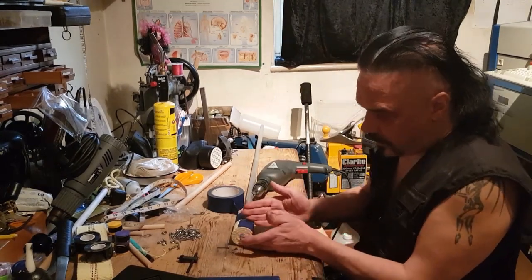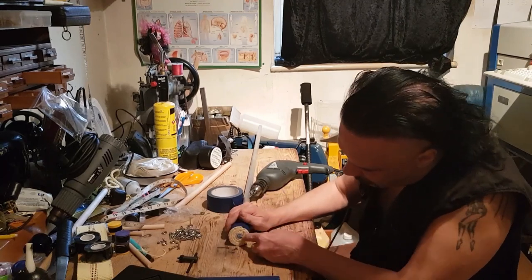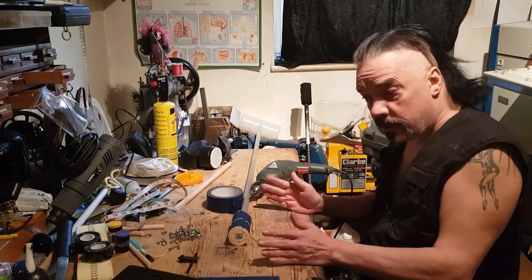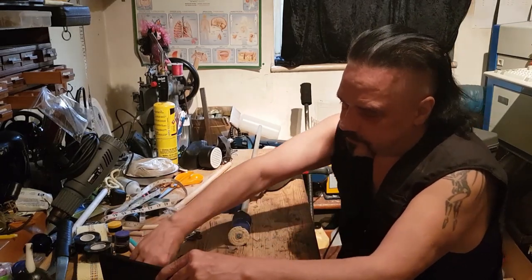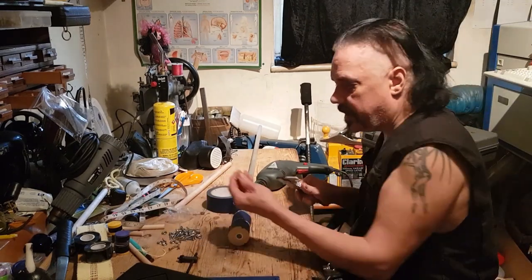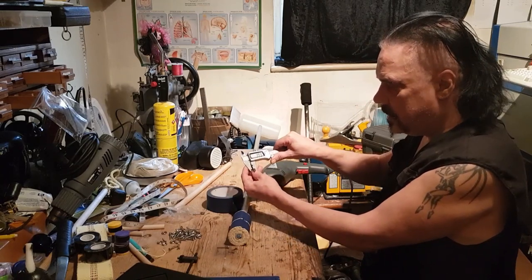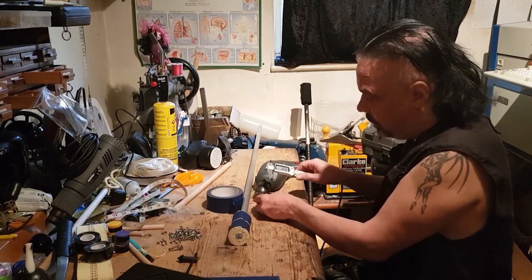Okay, I'm now going to drill through the wick to put the screws in, and the idea is I want to drill through all of the aluminium, I want to drill a bit into the wood, and I want the holes to be smaller than the screws. And so I've measured my drill bit. I know you can read the measurement off the drill bit, but I always believe in measuring things rather than trusting what they say. So my drill bit is 3.93mm, 4mm. Sorry, my screw is 4mm.